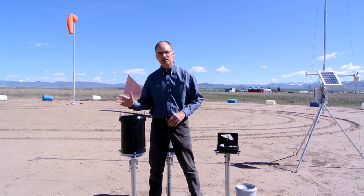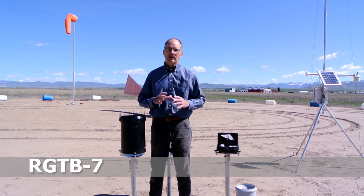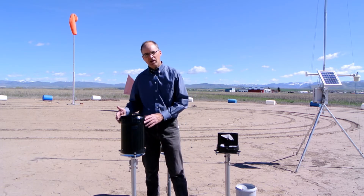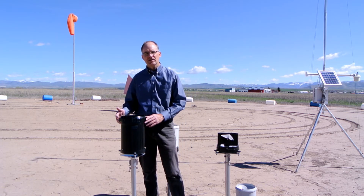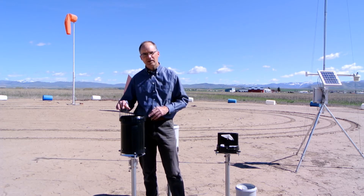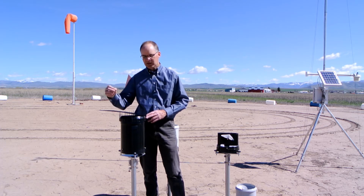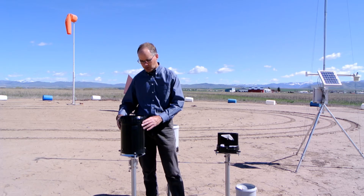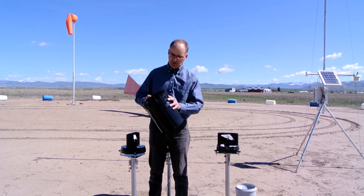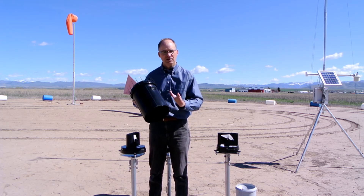The latest rain gauge to be released and featured on the Diacon website is the RGTB7. The rain gauge is identical to the 6 — the base is the identical mechanism — but the top is injection molded ASA. The advantage this offers is a lower cost, lower price point, and they have created integrated bird guard spikes. These are removable spikes that can be replaced in the field without tools, without any problems. It uses the same debris screen on the inside, the same keyhole slots for removing the rain gauge from the base, and the same venting system.